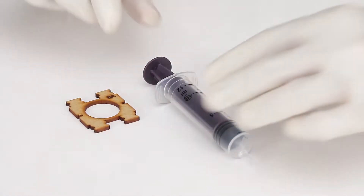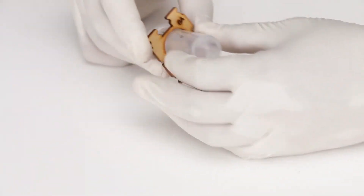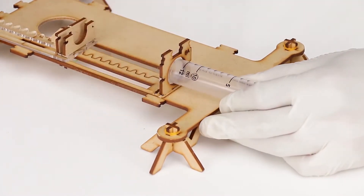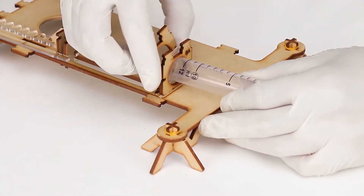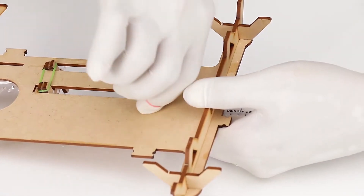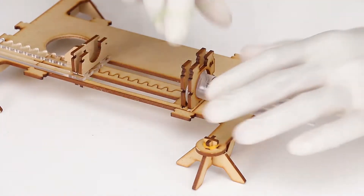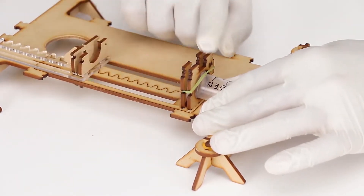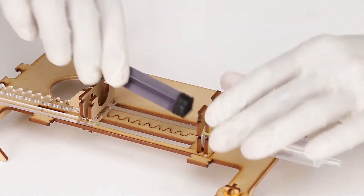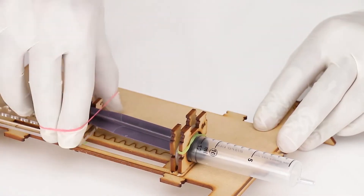Remove the body of the large syringe and insert the body into the hole of part number 8A. Insert part number 8A into the upper slot of part number 1. Then insert part number 8B into the slot so that the syringe is facing opposite the sliding rack. Secure both parts into part number 1 from below with a small rubber band, and also secure both parts by a small rubber band in the middle slot. Take the plunger, insert it into the syringe body, slide the rack set away for easy insertion, then place a small rubber band over the plunger to secure it.